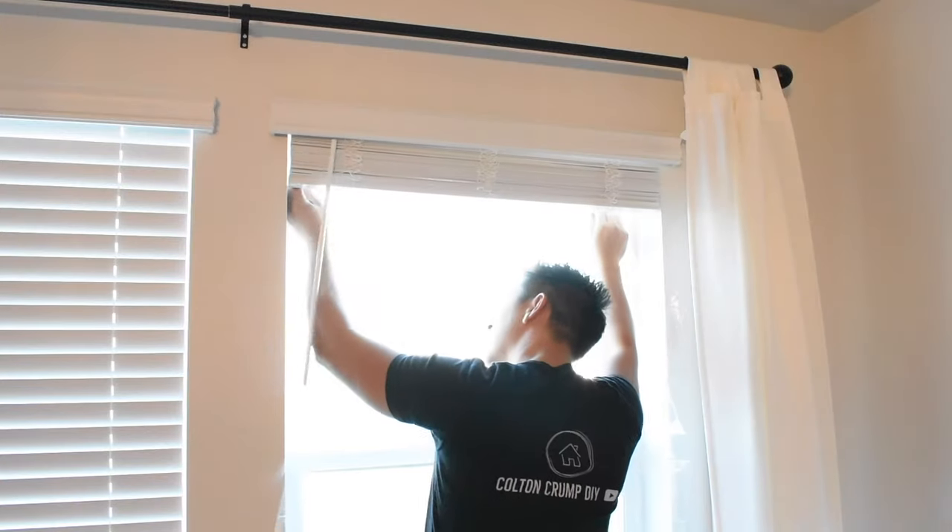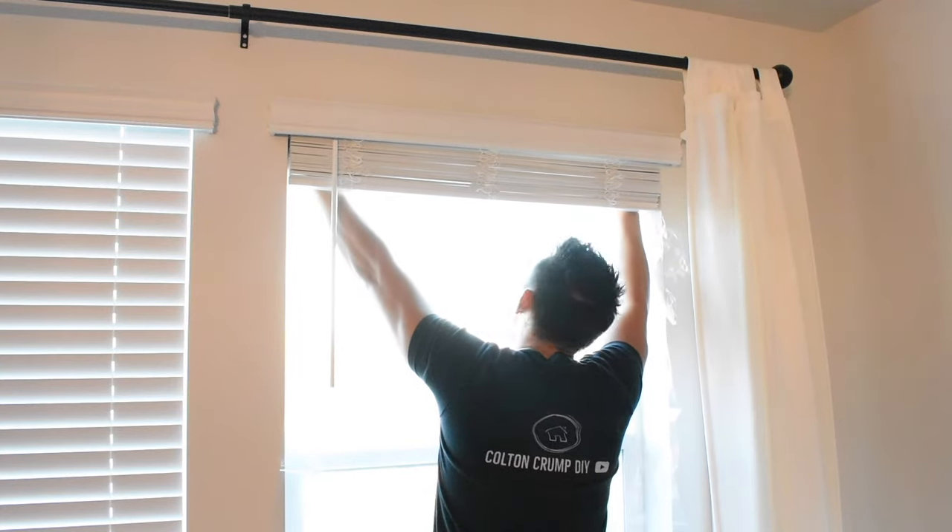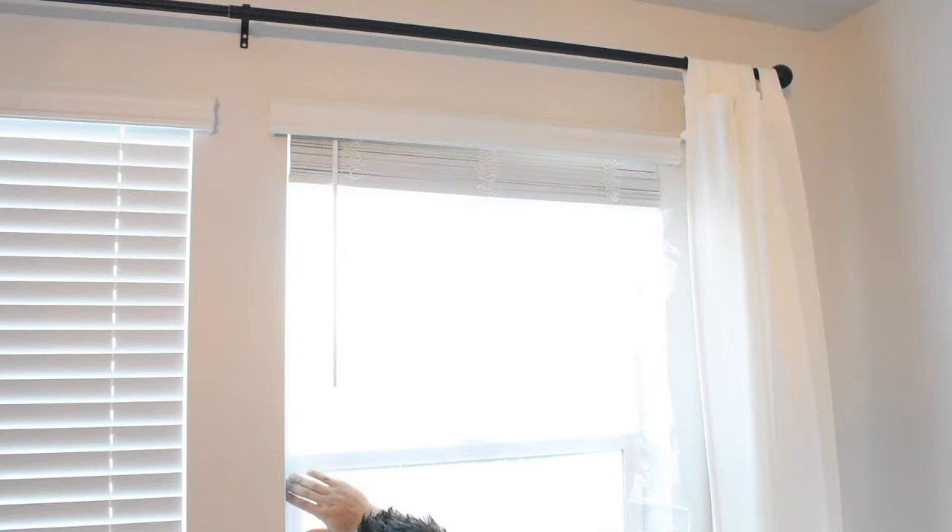I would leave at least a one to two inch margin all around your window. Open up the folded plastic, grab one of the edges with that one inch margin, and put it on your window. Make sure there's a nice seal and the plastic is in contact with the double-sided tape all around the window.